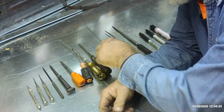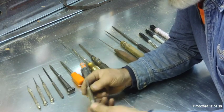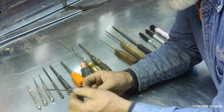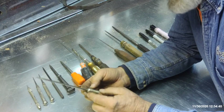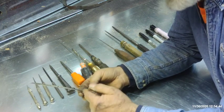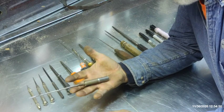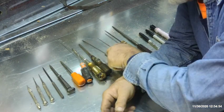One day I just messed around. I picked up an old broken bolt, chucked it up in a lathe and cut it down, drilled a hole in the end that matches a piece of tool steel that had knurls on it. I'd been using that as a freehand layout for small projects, so I decided to make a bigger one — make a handle out of that old bolt, like a five-eighths bolt. I drilled it out just a little bit where I got an interference fit, pressed the two together, sharpened it back again. I use this guy actually quite a lot. It stays here stuck in a hole on the workbench.